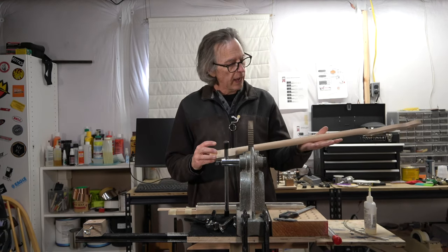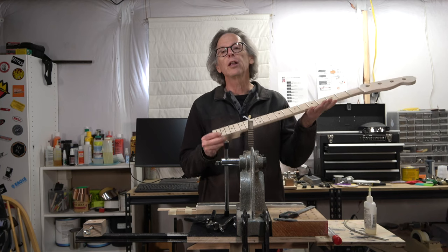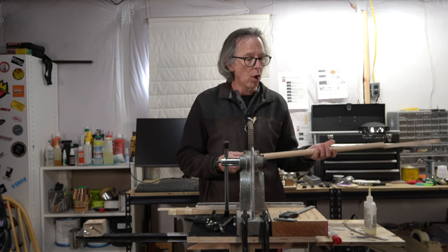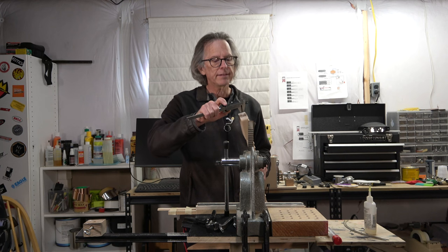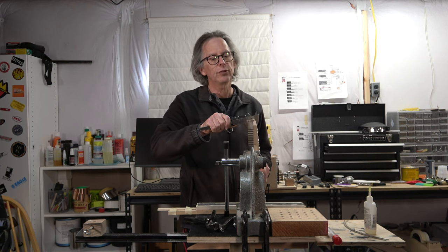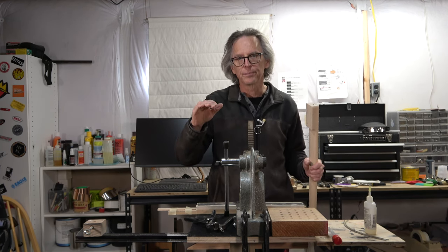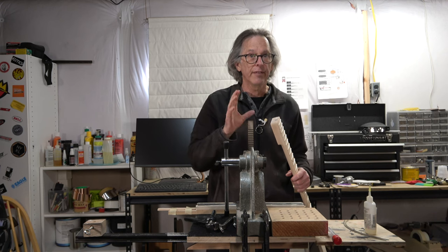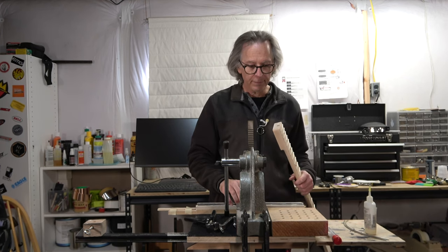The frets are all in and I'm at a point now where I can set the neck aside and start working on the body. Of course, there's still a lot more work that needs to be done on the neck — particularly the frets — but that's work that can be done later on. What I can do now is take my digital calipers and measure the thickness of the heel including the fret wire, then subtract the minimum string height at the bridge from that thickness, and that's going to tell me how deep I need to make the neck pocket. That's something I have to know before I can start any cutting or carving on the body — and that's all going to happen next week.